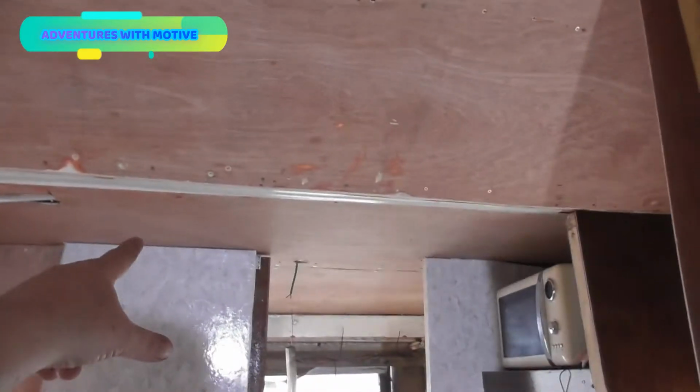The next job to be done is to get this bedroom space sorted out once and for all. We're going to line the walls, foam it out, pad it, and that's all that's really required. A cupboard is going up in there, and we've got white PVC, which is going to be padded as well. There'll be hardboard boards covered with foam and PVC, screwed up into position with little screw buttons, and then there'll be some LED lights situated in those areas all the way along and all the way over there.